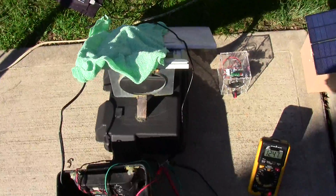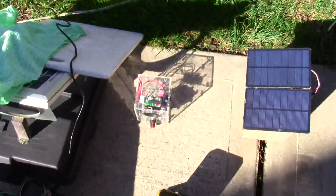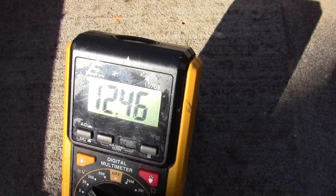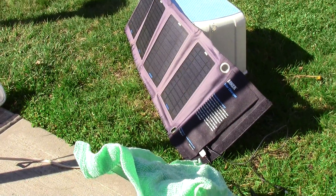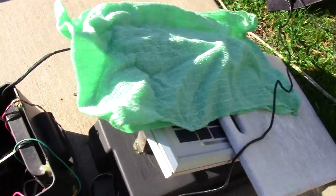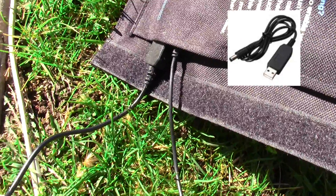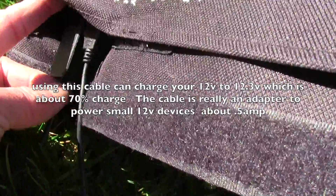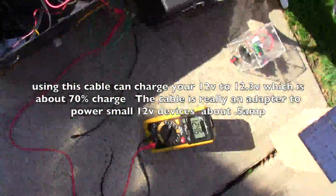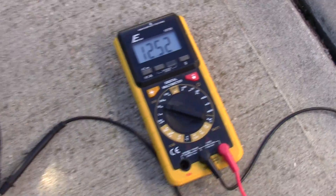If you're just using a USB cable something of this nature — I'm getting 12.46 volts out from the solar panel. So how do you do it? Well, it's very simple. You can just use this cable here. This is a regular USB cable with a voltage booster built-in. It just pops into the USB port and it ranges from 12.48 to 12.52 volts.